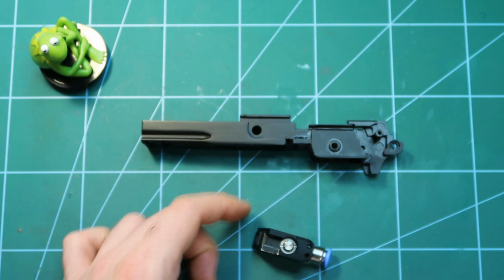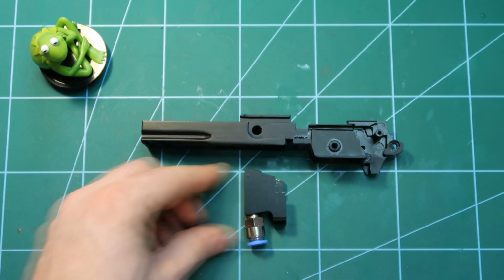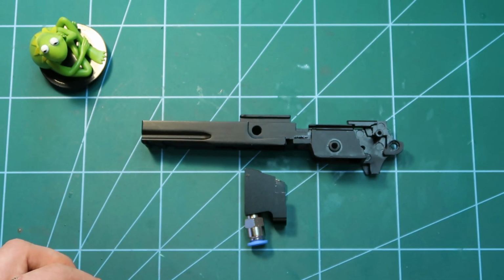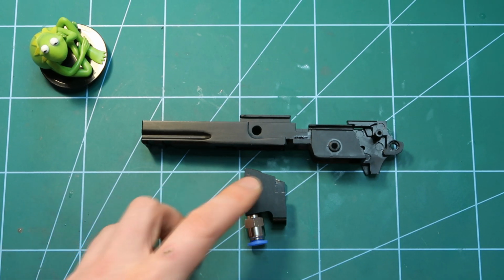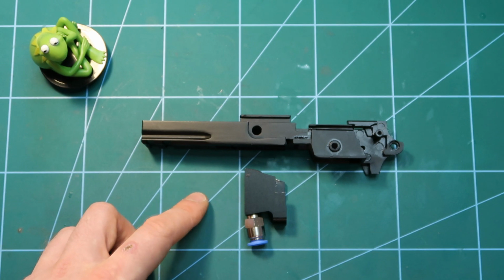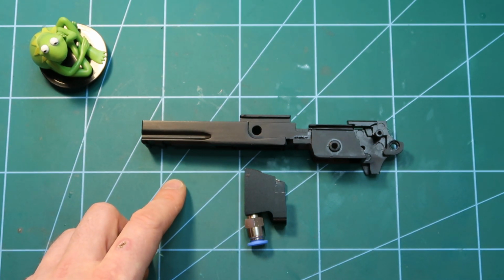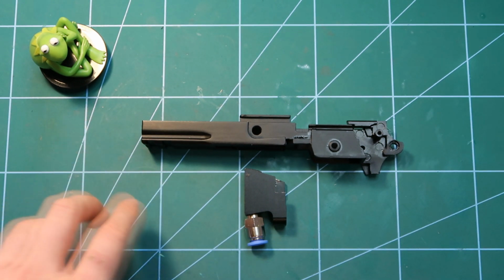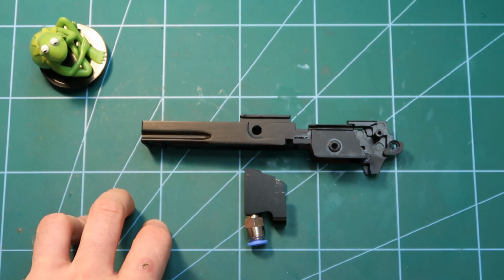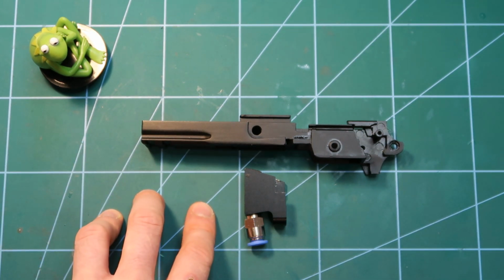And the best way to drill these kind of holes is to always use a smaller drill than the target. The target will be 2.5 millimeters hole in diameter, because the screws that we are going to use to attach the conversion will be 2.5 millimeters. So I'll start probably with 1.5 millimeter. And I will make sure that these small holes are centered, because if I miss a tiny bit, then by switching the size of the drill, I can drill a little more in one of the directions to increase the size of the hole in this particular one.